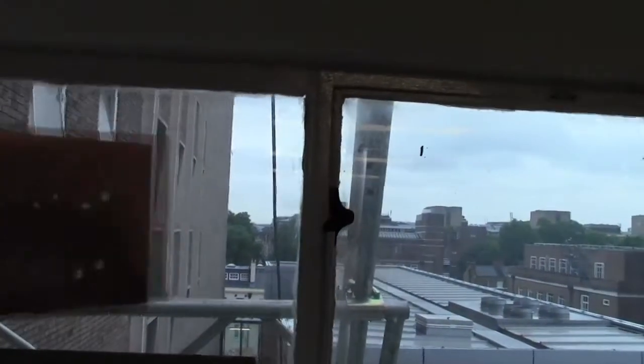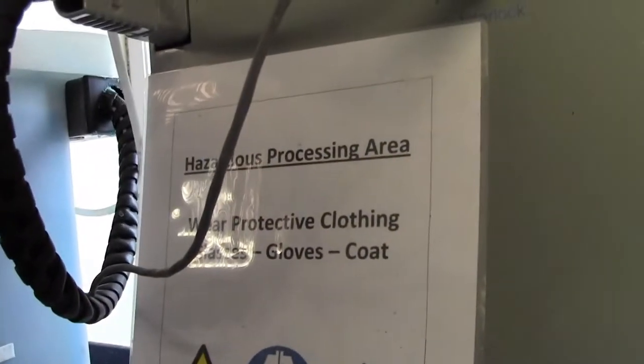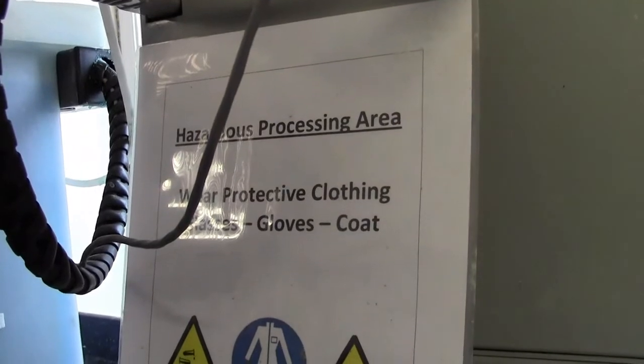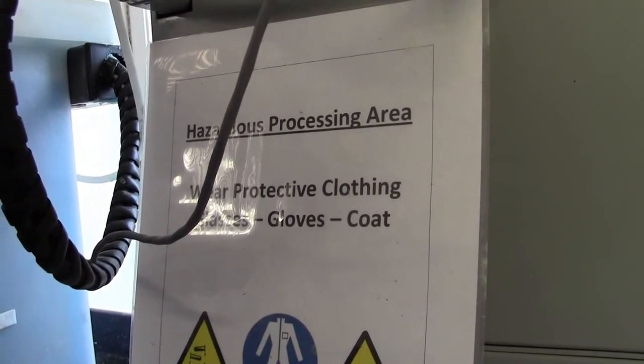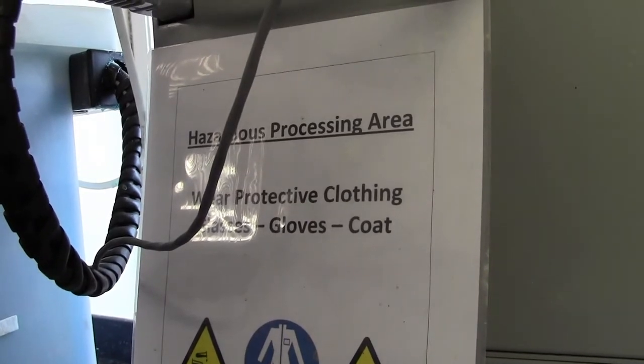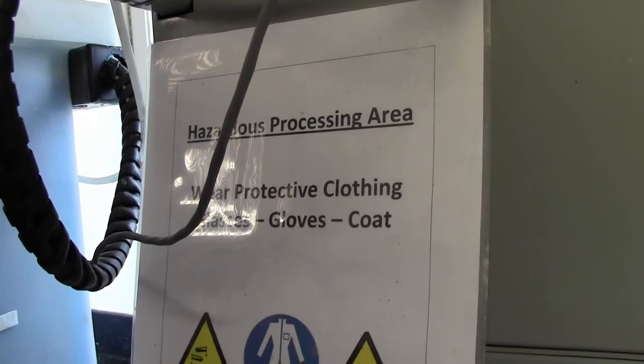And if we look at the light, you can actually see through the holes, they're all clear. You can see that. Lovely. If your holes aren't clear, make sure that they are. Just blow an air duster through them to clear them out in case there's any activator still in the holes that may have cured up and blocked them. So just wash it down, dry it off with a paper towel, blow the holes and you're done.